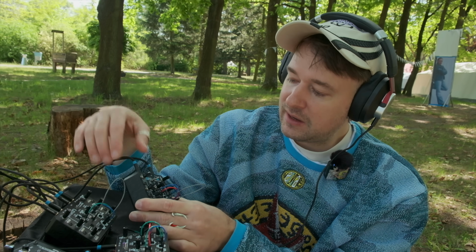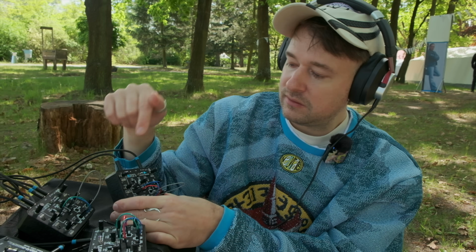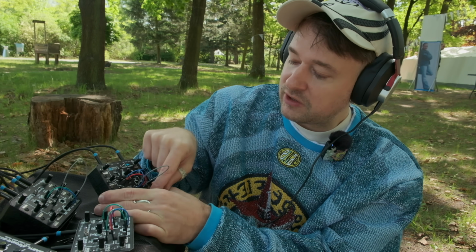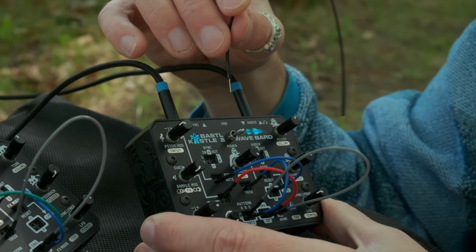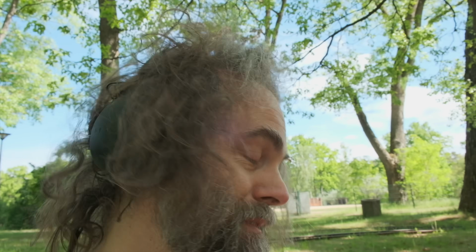These sync jacks are Eurorack compatible, and we actually use stereo jacks here. In the patch bay, you can access either the left or the right channel on the input jack, and a left and a right channel on the output jack. So if you were to feed it totally different stuff on left and right, you can. Exactly. So you have basically 4 channels, in or out, that you can connect to your modular.